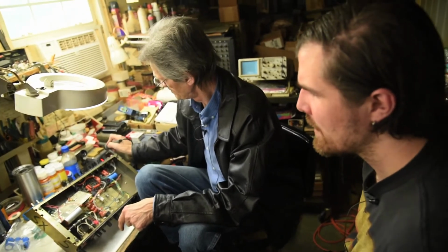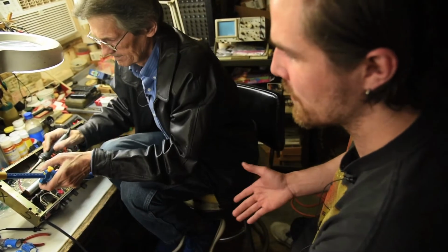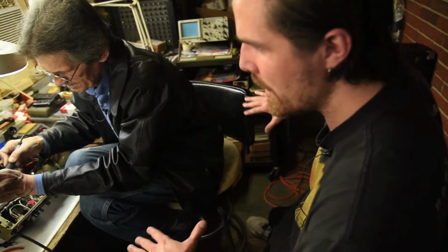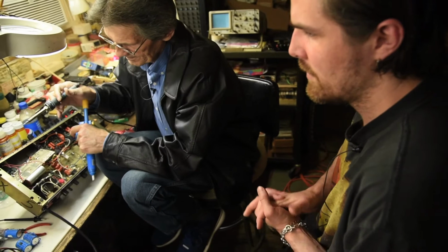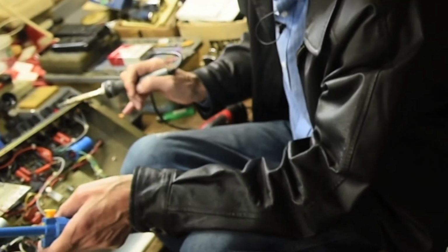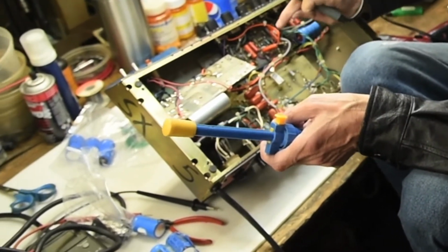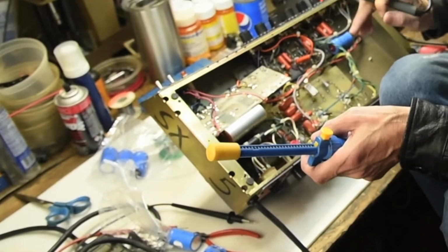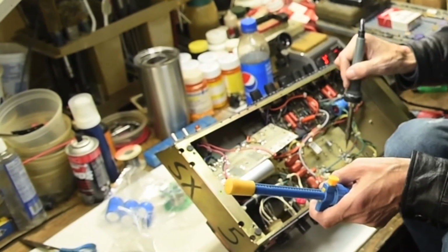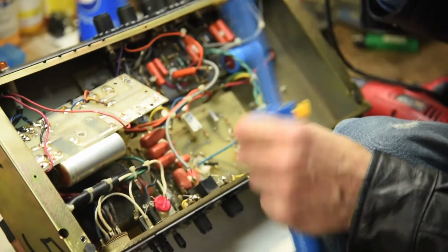But there's a lot of magic in that high voltage. It's got a better sound to it, I think. Doesn't the voltage result in the signal enhancing even more? Like it's creating more amplitude after the power section, so it literally creates a bigger wave before it hits the output transformer. It starts from your first tube right here at the input jack, and at every step, every tube, if you check the output of that tube, the signal will be a little bigger until you get to the phase inverter, which feeds these two tubes. It sends half the signal to this one, half the signal to that one, and feeds the power section. It's called a phase inverter.